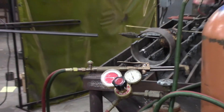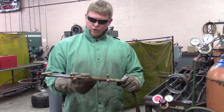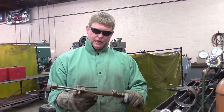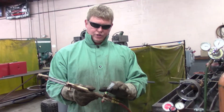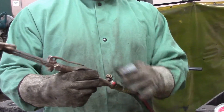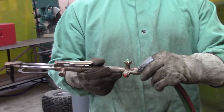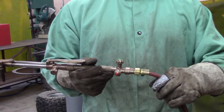Once you have your pressure set, come over here. This is a multi-use torch — it can unscrew and you can put a brazing tip or an oxyfuel welding tip on, or whatever. You want to open this green one, which is your oxygen, all the way up, because your adjustments are going to be made up here. If you had a straight cutting torch, this wouldn't be there because that's all it does is cut. The red one is going to be your acetylene — you can see it's left-hand threaded. It's got notches right there on the nut that goes on the torch to tell you that it's left-hand threaded.